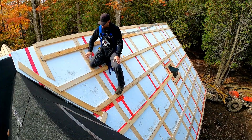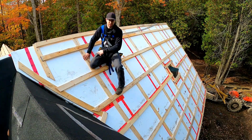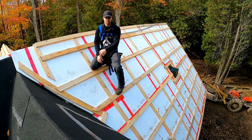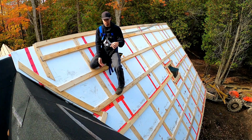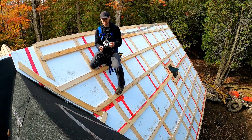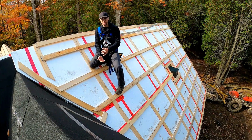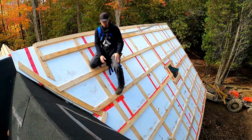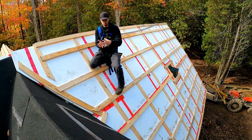And then we strapped it down with these vertical straps first, which are spaced directly over the cabin rafters. So when we put in the 6-inch timber lock screws, they go down through the strap, through the insulation, through the leak barrier, through the plywood, barn board sheathing, and right into the rafters. And so that sucks it all down and holds the whole roof tightly together.